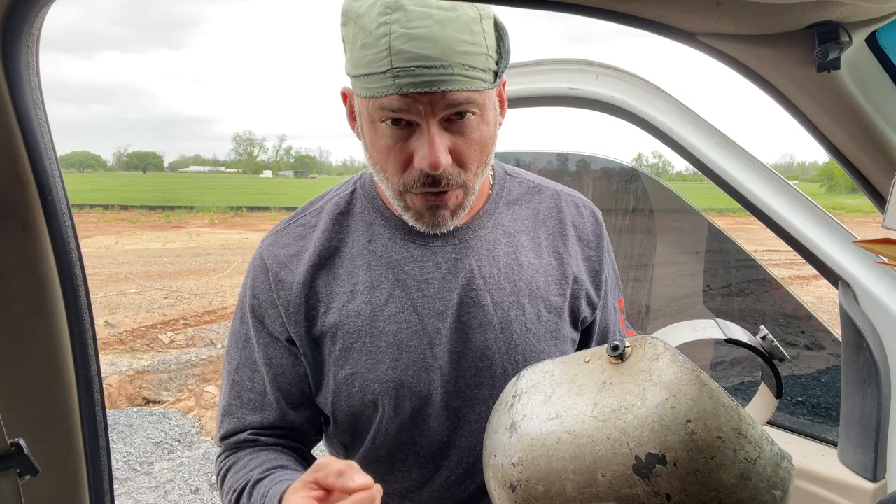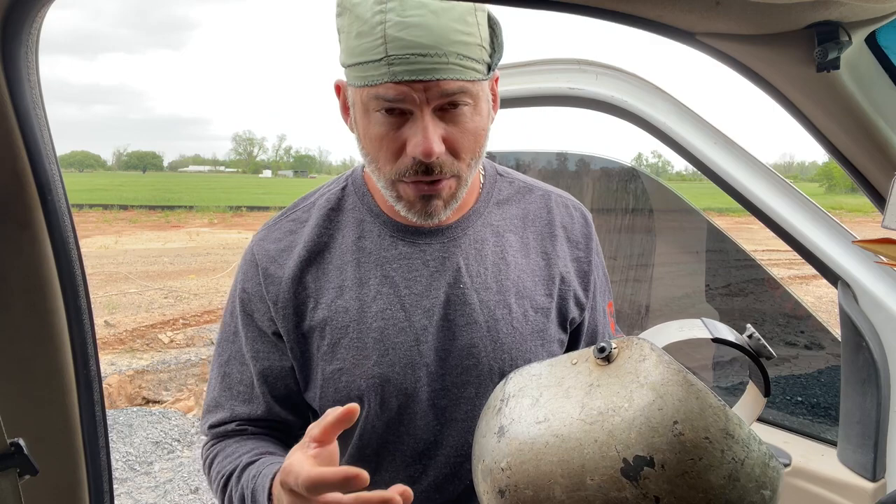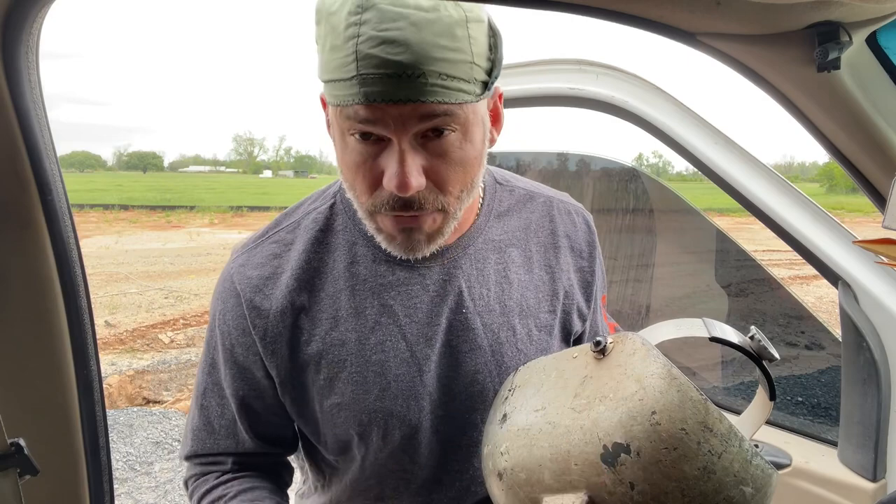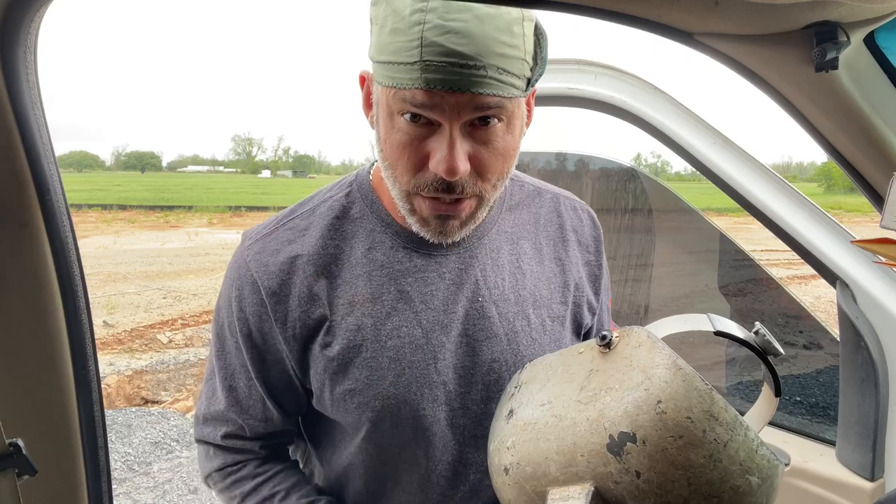Speaking of seeing - cheaters: if you've got to have a cheater, use it. If you don't absolutely have to have one, don't mess with it. I thought I could use one because I could see better, but I think it screws with your eyes - you've got to be right here, if you get too far away it screws up, if you get too close it screws up. So just let your eyes do the work. If you do need one, just know you've got to get a different pancake - it has a bigger gap to allow for about a quarter-inch cheater to slide in.